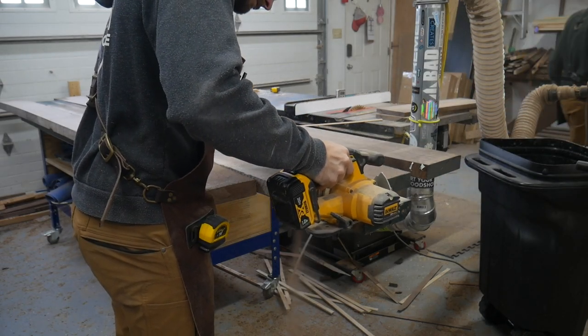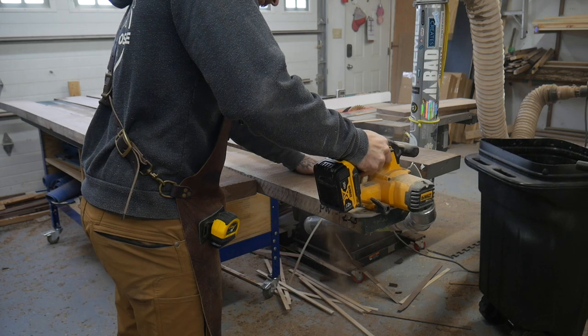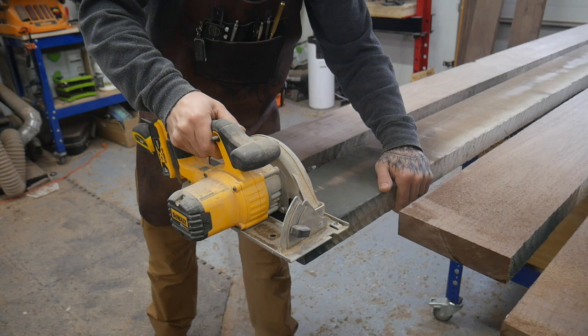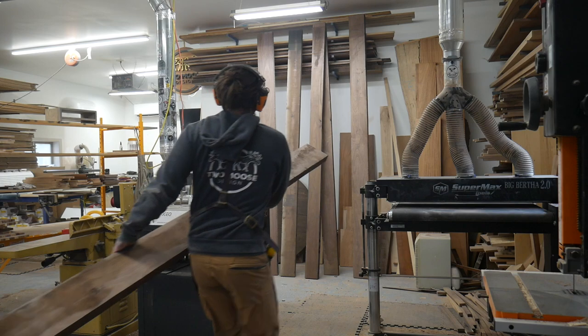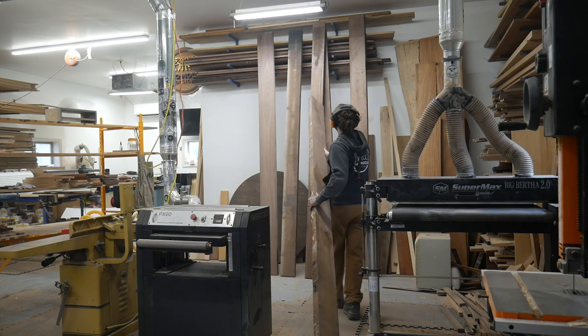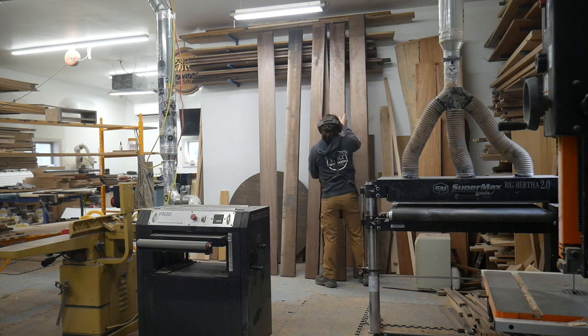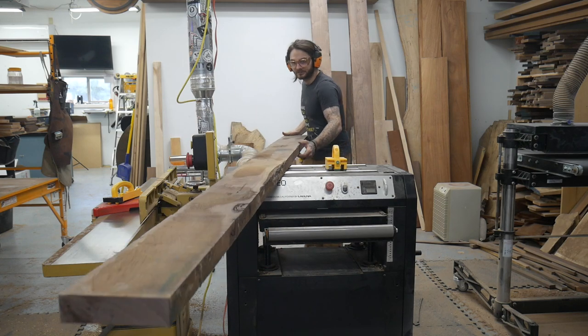This table is going to be nine and a half feet, so we're going to start off by zipping off the excess to make it a little easier to manage and cut off any checks or cracks in the end. I always like to get a couple extra boards just in case something goes wrong or if one of the boards has a big knot you didn't notice. These are the boards I decided were the best for the build and now we're just going to go through them and figure out which sides look good and where to start milling this lumber down.